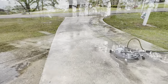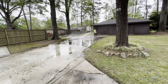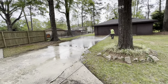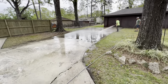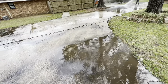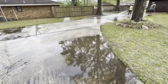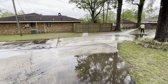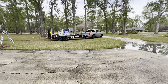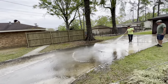Surface cleaning literally took about 33 minutes. Once you watch our pricing video on the website you can calculate how many square feet it is and figure out how much you can make per hour surface cleaning. Right now we're just using an open hose rinsing high to low. There are going to be some dependent areas and I'm not going to sit out here for six hours trying to push this water out — I may swing by the next day with a blower. I've got both machines paired together running about 6 to 7 gallons per minute each, so out this hose I'm putting at least 12 to 13 gallons per minute.